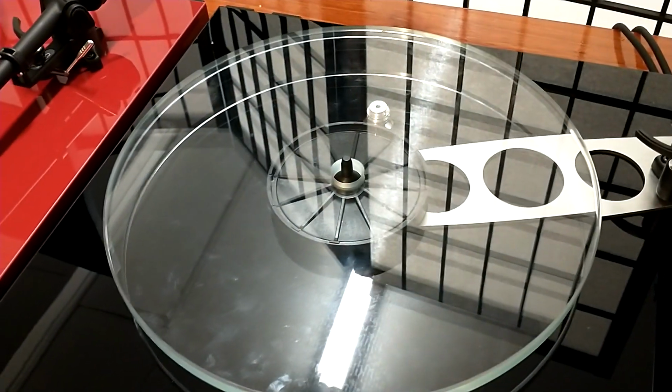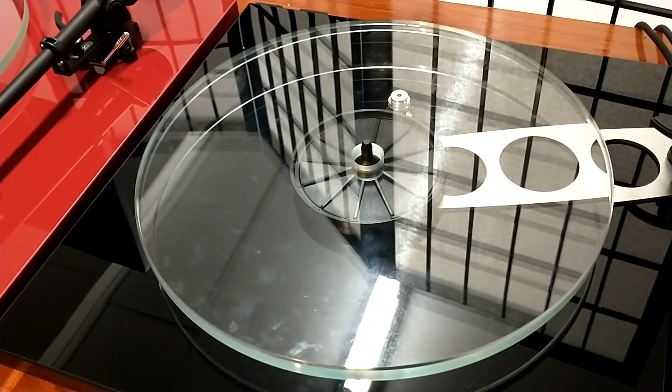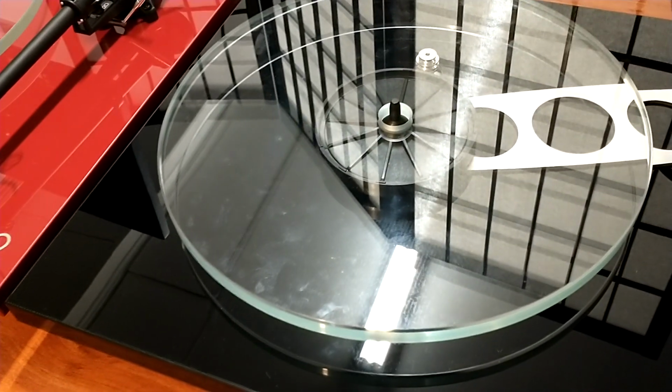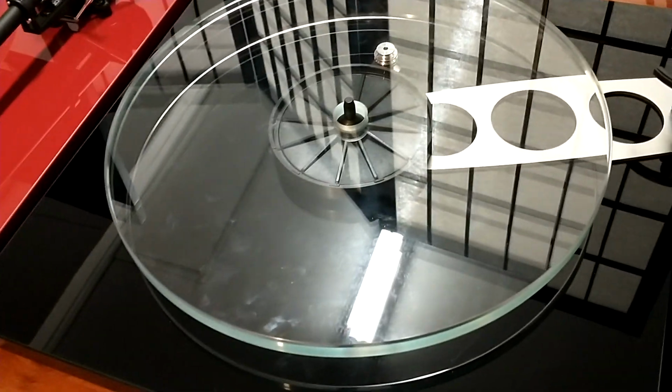The bonus of using the Neo is that it essentially then decouples the power. It buffers the power coming out of the wall to DC energy and then oscillates it correctly, precision to the correct frequency for the motor, for the AC motor.